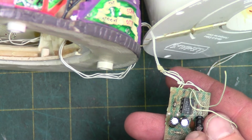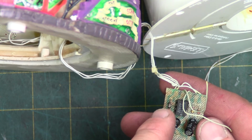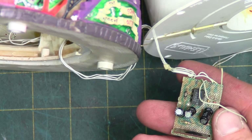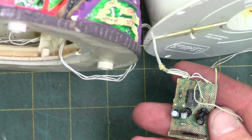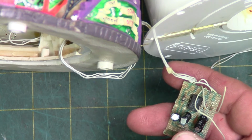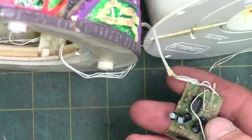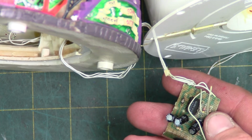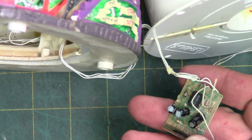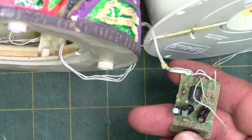The ceramic capacitor is that thing down there, kind of a brownish tan. So this one, not a clue what the resistance was. Right now with the tester, using it as a meter, which is off screen now, it's 5.5 megohms, which is probably too high for something this small. These 2 resistors on the right, one is 1.1K and one is 1.0K, or 1,100 ohms and 1,000 ohms. The 2 down here, starting with this one on the left,